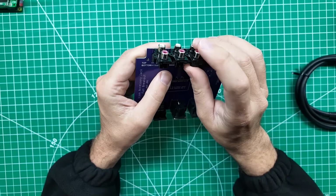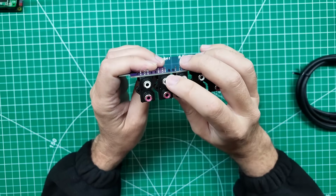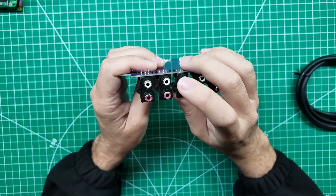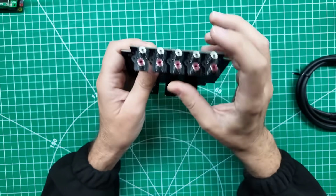ALC is your limiting circuit from your amplifier to tell your radio stop shouting at me. Band is so that your amplifier can automatically switch bands, and there isn't any band voltage data above HF, but for all of your HF frequencies you can read here how much voltage is on this connector, and then you can change the band on your amplifier.